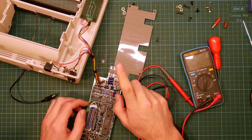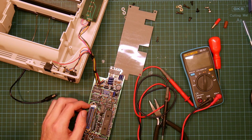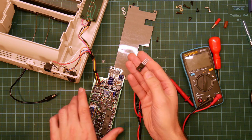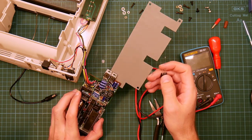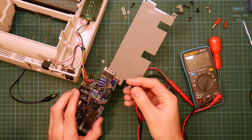The HA17805 is a completely standard 5 volt regulator. And in my junk drawer, here is a completely standard 5 volt regulator. So I think I should just remove this and replace it and see what happens.